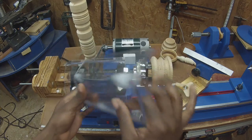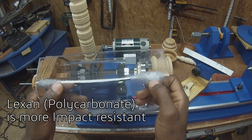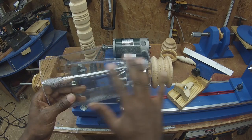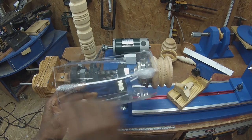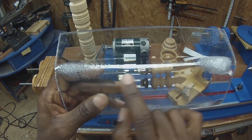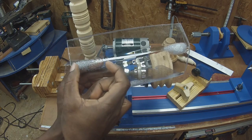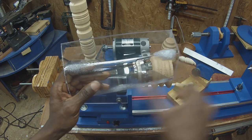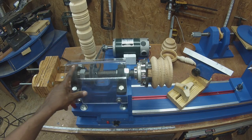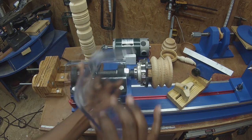I left the film on. Now this is Lexan, by the way — this is not the same as plexiglass, so its behavior is slightly different. The same precautions need to be taken: when you're heating it, you want to spread the heat out nice and even. Try not to stay in one area too long, which is what I kinda did here — it's more bubbly here but nice and clear in the middle. I changed my path to even out the heat on this one, and as you can see that looks a lot better. So that's a quick tip about heating and bending Lexan.